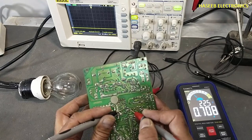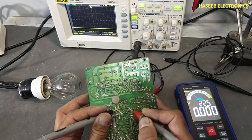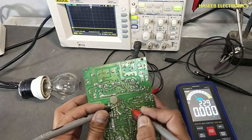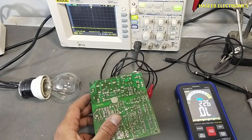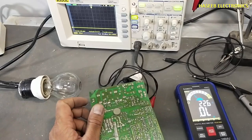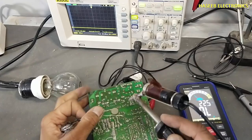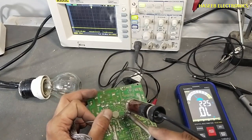Base to collector — the transistors are looking good. I think these diodes are bad. Now I will remove the transistors and diodes. It is best to test them out of circuit because the circuit can give a parallel resistance reading.